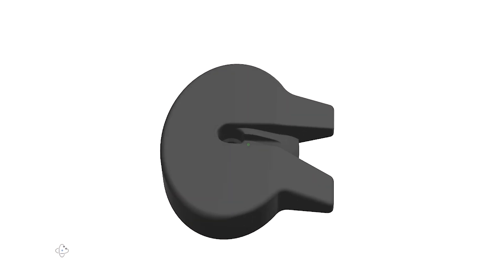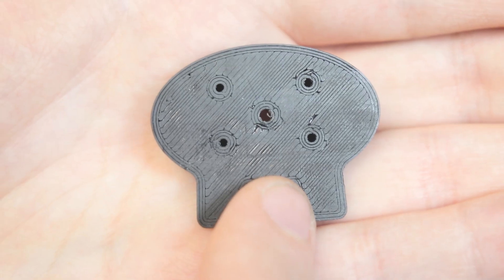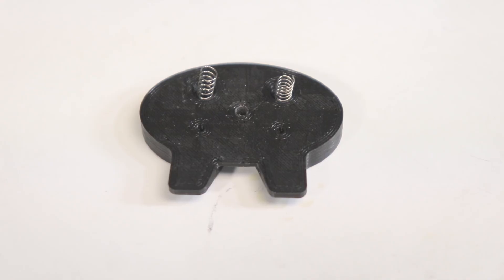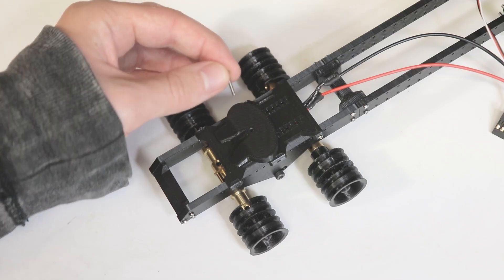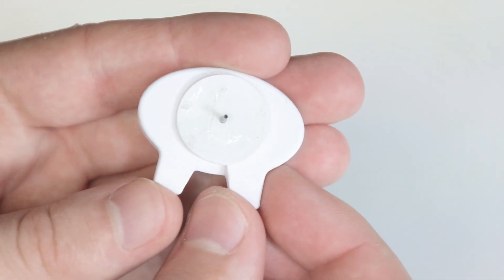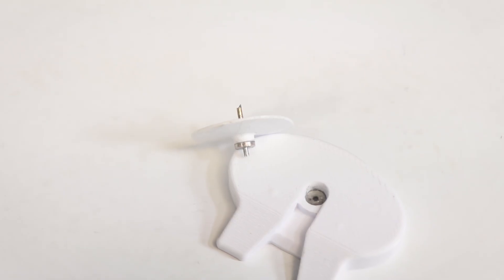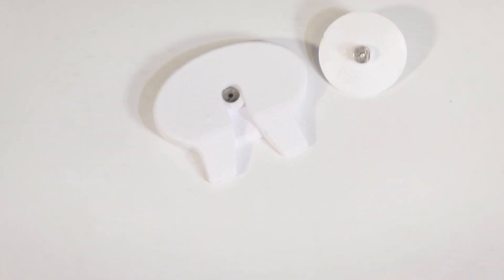Keeping with the goal of designing all parts to be as easy to 3D print as possible, this fifth wheel is no exception. A few variations are currently available. On the bottom of two they are completely flat, while the remaining two have a spot for some springs to sit on the top side. One variation uses magnets to help secure the trailer in place, while the other simply uses gravity and a two millimeter diameter fastener or rod. On the magnetic version you can use a couple of four millimeter magnets and a one millimeter rod or fastener to ensure the trailer will be securely coupled to the truck. This connection seems to be pretty solid while still not requiring much force for the trailer to rotate. If a stronger connection is needed, simply choosing a slightly larger diameter magnet should do the trick.